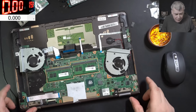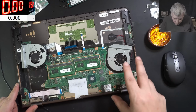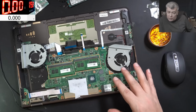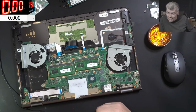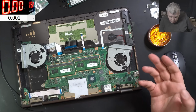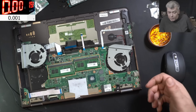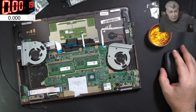No. Okay, so I'm going to stop here. I'm happy I helped this customer. We fixed the laptop. If you have this particular model, you really need the other PD controller, otherwise it will not work, which is insane. I never found something like that. I mean, we replace PD controllers, but usually, if one PD controller is dead, the other port is still working, but not on HP.